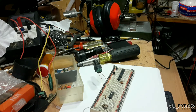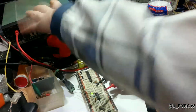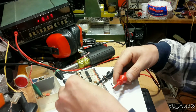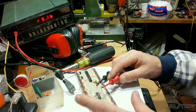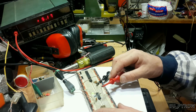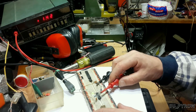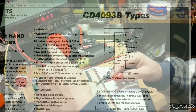I've got a meter here — we can actually see it, good. We're going to take our plus five volts and you've got to be quick because all the inputs and outputs are floating. Go to pin one — we see five volts, good. Pin two — five volts, good. Pin three is an output, so we should see a drop — and we do. That tells us it's an output.